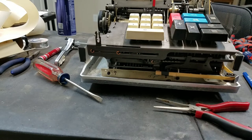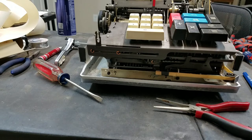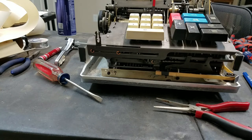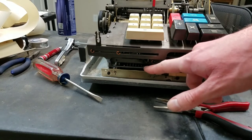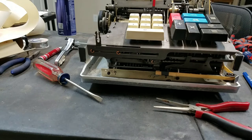So basically, there are many cams on the back shaft. One of the cams on the back shaft causes a lever that runs all the way from there up to the front to go backwards towards the back of the machine as the machine is going through a cycle. And that lever has a peg sticking out of it, and that peg can either engage or disengage with a lever that comes over to raise and lower these. So the order of operation for the rods to engage or disengage with the pegboard is: at some point in the cycle when that lever starts moving backwards, the lever that comes off of here has to engage with a peg on that lever, so that as that lever goes backwards, it rotates an assembly in the front here, towards the back of the machine, and that lifts up the front ends of these risers to engage with the pegs on the bottom of the pegboard.